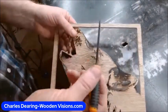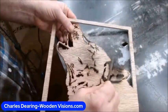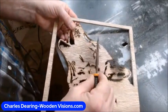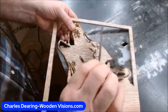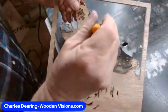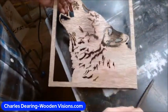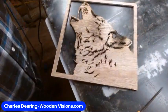It still comes back to the needle file. These are just different ways that make the whole process a lot quicker and a lot less frustrating. When using the needle file in an area I didn't burn, I'm using the edge to knock it sideways and then just sand or file it off — just like that. It's a combination of whether you want to do power sanding, burning, or hand sanding, but those are the ways to do it.